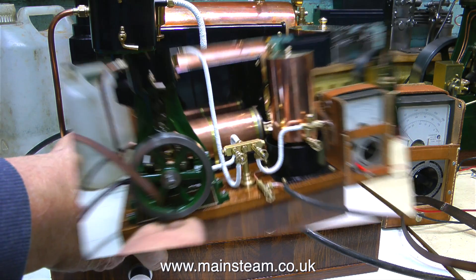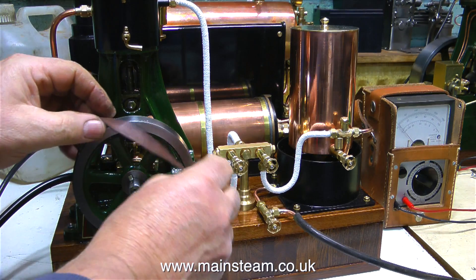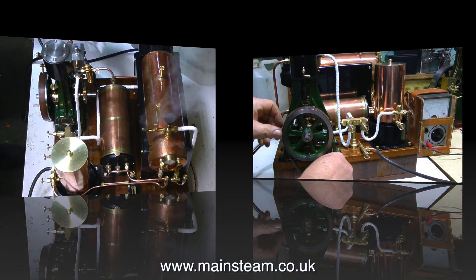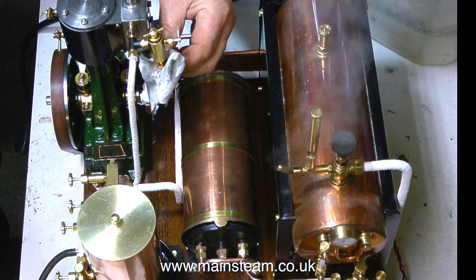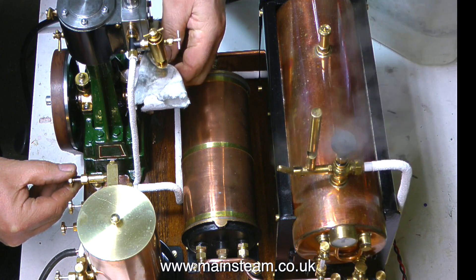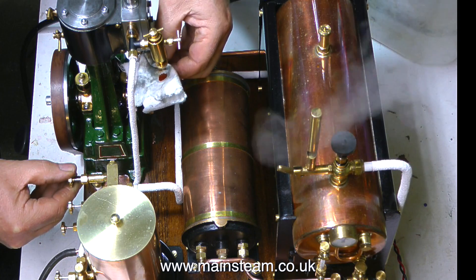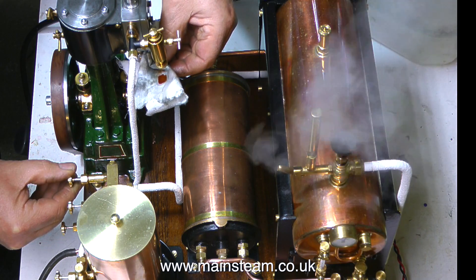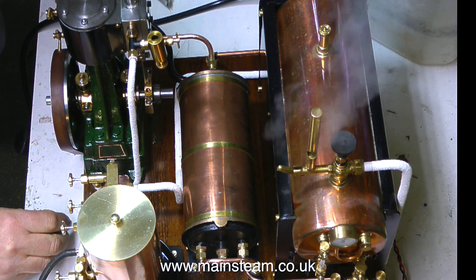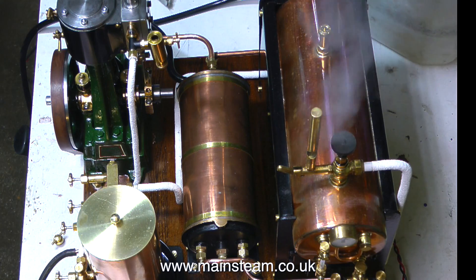As you've just seen, this is a really powerful engine. When running at high speed, with my hand firmly on the flywheel, I can't stop the flywheel from rotating. I've got the camera sat on the tripod on the bench over the steam plant, just to give you a different perspective. I'm emptying the displacement lubricator, and you can clearly see the water coming out of the bottom, followed by some oil — so it wasn't completely empty anyway — followed by some very weird looking red oil. I'm going to refill it with my normal steam oil mixture when I can find the oil can.